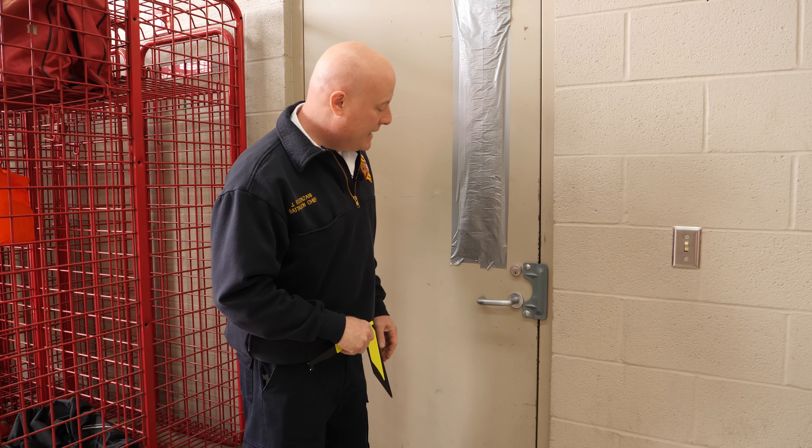We've also got two tools for the secondary or add-on locks typically found in hotels and motels — the swing bar door lock and the privacy door latch. One advantage in hotels and motels is that we typically have a key or key card for the main door lock, but for the secondary lock we need one of our tools. For the swing bar door lock, we use the do-not-disturb sign as a leaf spring to pop that bar right off the locking post. We open the door as far as we can, verify the lock is in place, slide the sign along the bottom bar of the U-shaped swing bar until we make contact with the ball and post at the end, hold the do-not-disturb card in place, and close the door.